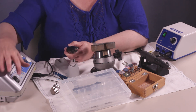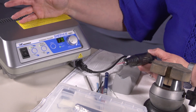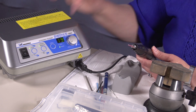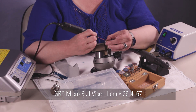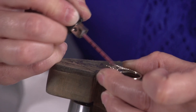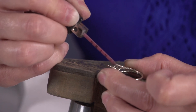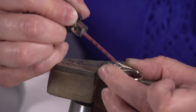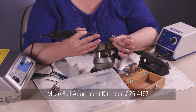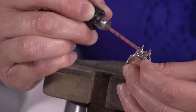So now we're going to go ahead and turn it on and start operating the machine. We don't want the foot pedal on, so we want that to be reset. Now we're using just the hand piece without the foot pedal, and our display is on power, set at 19. So we're going to start working this. There's no getting around that sound — you're just going to have to deal with it. But if the machine is set too high, it makes an even more aggressive sound. The good thing about working with the ultrasonic polisher is that if you're working with a round, you can keep the rounds round; if you're working on a flat, you keep the flat flat. You're basically going to keep everything nice and crisp, and remove whatever texture is on there that you don't want.